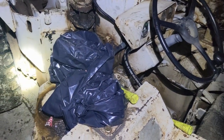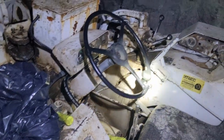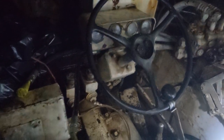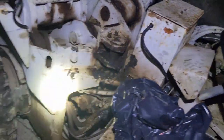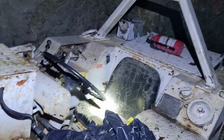Our driller wasn't up there when that happened. We told him about it. He just laughs and says, 'sounds like mining.' Yeah, he's got it right. I'm sure our key is out of the key switch. The battery hot terminal is disconnected, just so the machine can sleep down here. It does have some parasitic draws I need to work off and install a master switch. For the time being, she can sit here for a bit.